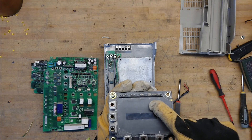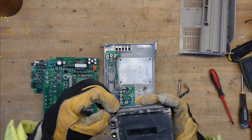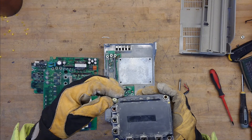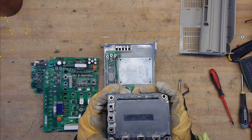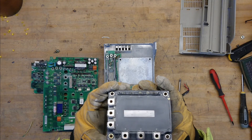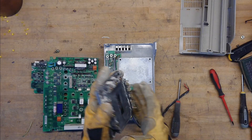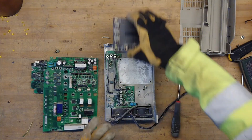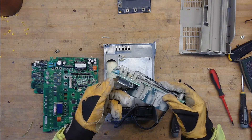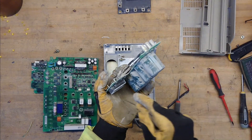We have the three gate drives here — markings read just 10 and 16 — so this is probably some of the extra control or surveillance circuitry. Up here we have BPN, which could just be the brake chopper. And you have U, V, and W for the three motor connections. Copper base plate — pretty heavy actually. It's a shame it cannot be reused.